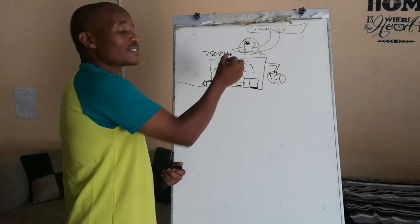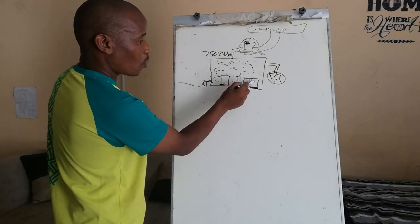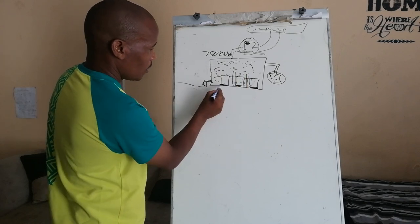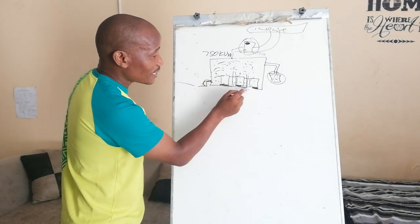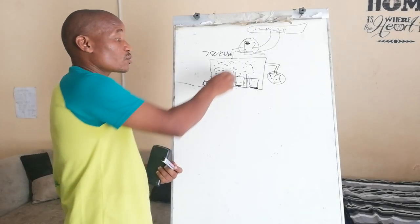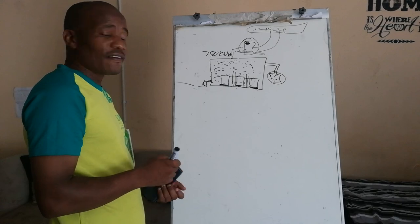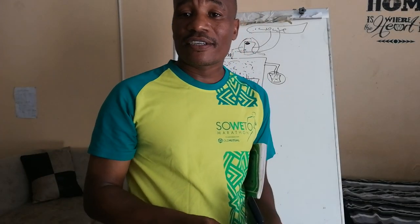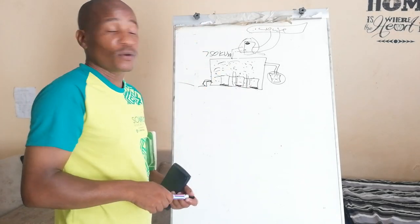And then we mentioned that this oil serves a dual purpose: it conducts heat away from the main core and improves insulation. Remember, there is insulation here, like corrugated boards and also wood, to ensure that this coil doesn't touch this metal plate. The oil strengthens those insulations so that they become stronger and stronger. And that oil must also have specific qualities like dielectric strength, flash point and so on. You might even be asked to give the 8 characteristics of a transformer oil. It's not necessarily a transformer oil, it's a synthetic oil, but in practice we just say transformer oil. We know what you are talking about.